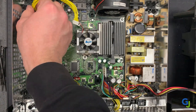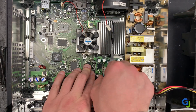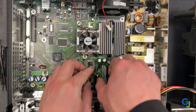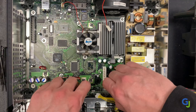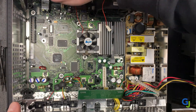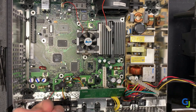I'm working on a 1.0 version Xbox for this example, so there are two separate fans. The case fan all the way in the back needs to be removed, but the heatsink fan can stay in place. After that, the main power connection is next — it's towards the front and is typically tough to remove on these 1.0 units. Just be careful to remove it slowly so the wires aren't pulled from the connector. Then the controller port connections and front button panel connector can be removed before removing all of the T10 screws holding the motherboard in place. Remember to remove all of the wire connections first before removing the screws, so the board will stay in place and not flex as much while pulling the connectors out, especially with the main power connector.